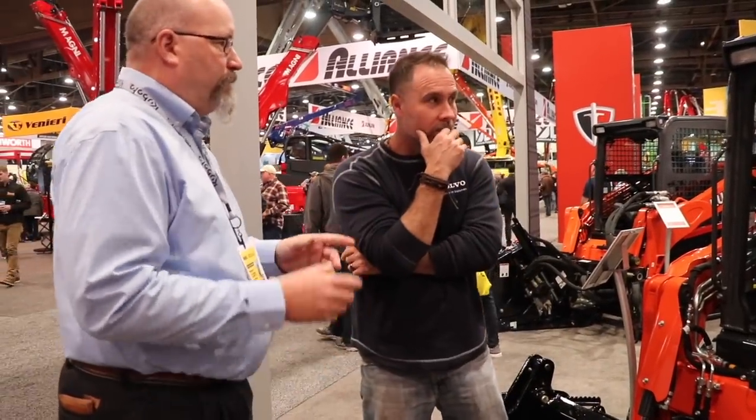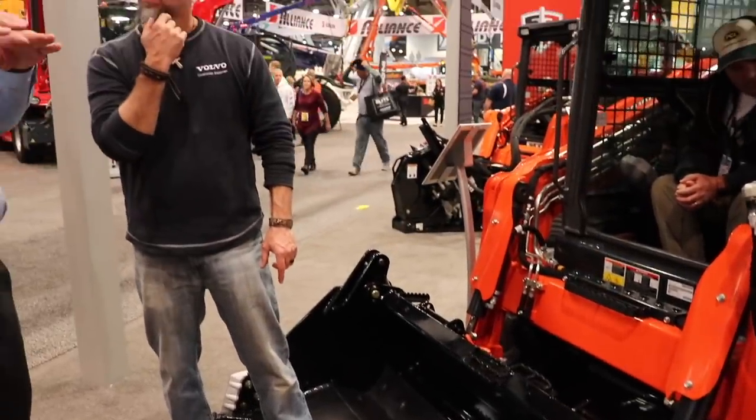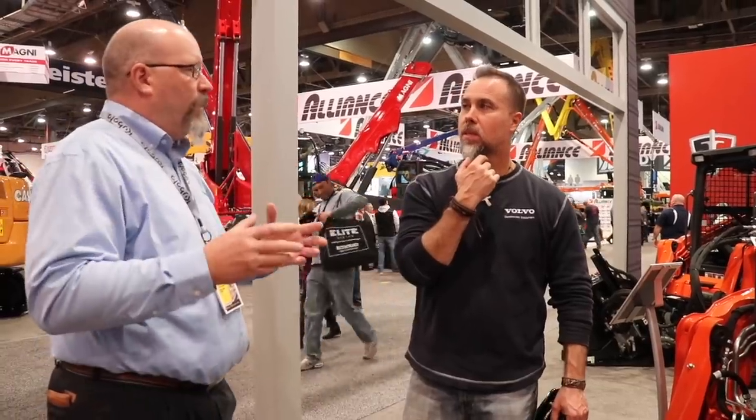Besides the size and weight difference, the biggest thing on this that I think is exciting, we changed the hydraulic valving. So now it's a parallel series valve. So if we want to, say we've got a 4-in-1 bucket on this one. If we want to raise the boom, curl the bucket, open the 4-in-1, we can do it all at once in one smooth motion. Without one drawing down off the other? Correct, because of that parallel valve instead of a series valve. I was going to say, so you're still running off one hydraulic pump? Yes. So you're not doing multiple pumps, so you have just a different valve platform. So the point with not having multiple pumps, you guys, is when you have multiple pumps, you have multiple problems. When one goes out, well, your machine is down. If you've got one main pump, and you're just changing the valve configuration. At that point. Makes sense.